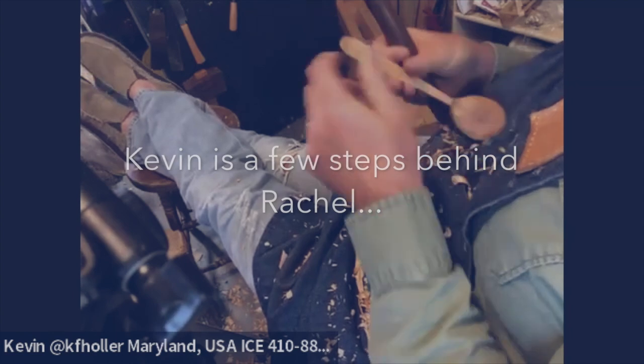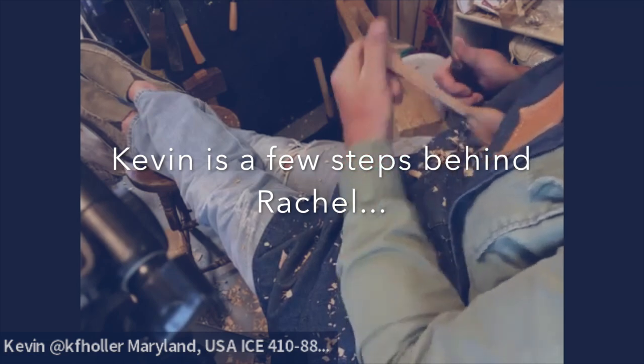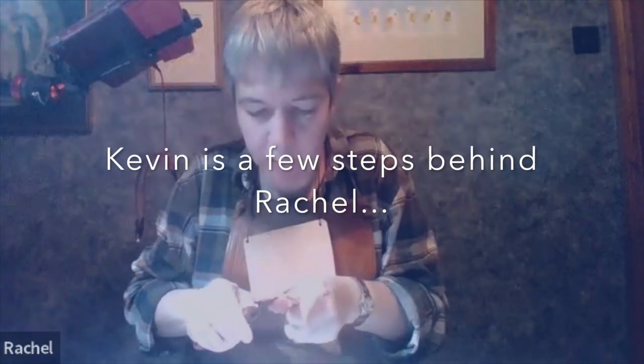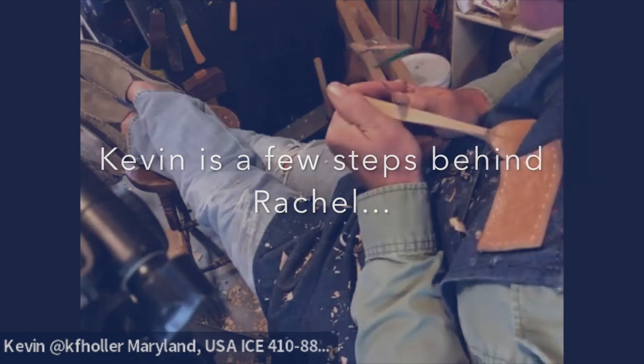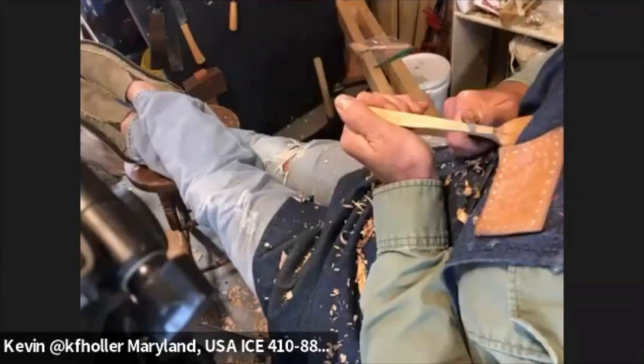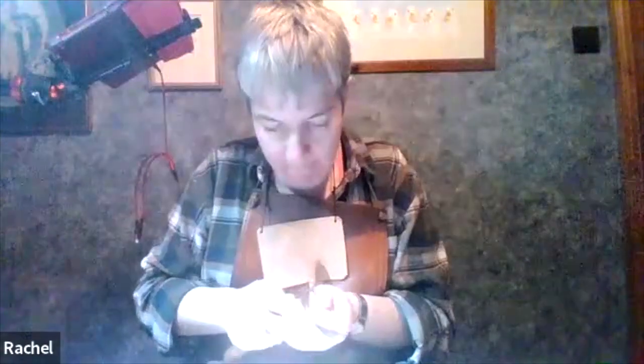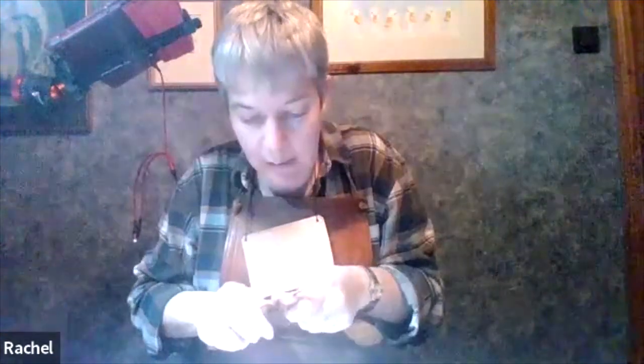So now that I've faceted the back corners off, I'm going to bring the neck in more narrowly. Judging by how, I mean, you perhaps don't want quite as delicate looking a spoon. This step here is where it really pays off that we lined up the grain and made straight grain. And that we chose the nicest blanks that we had. So that's the back of the spoon. Pretty much done. And you can faff to make sure that those chamfers are equal.